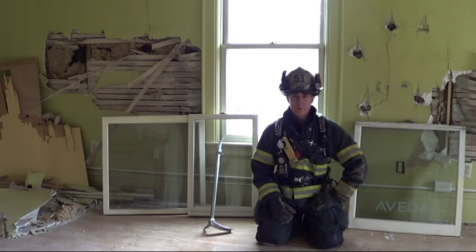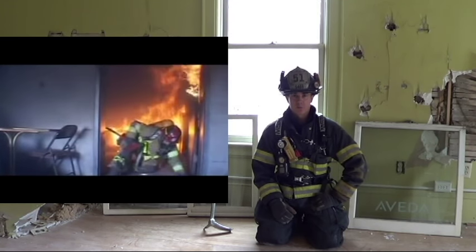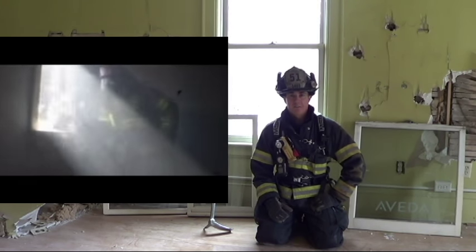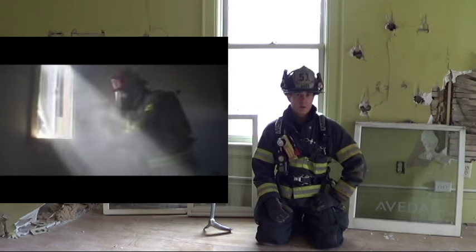In this session, I'm going to take you through window clearing for emergency egress when deploying a personal escape, personal safety, or a versatile rescue system. This is a component that's often neglected or taken for granted when training with these types of systems, but it can be a critical element if you're trapped in a room that's rapidly approaching flashover and you need to get out in a hurry. If the window you're going to exit from is still intact, the faster you can take it out and clear it of any hazards or obstructions, the better off you're going to be.